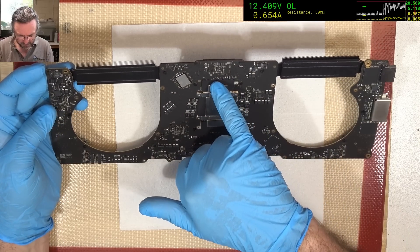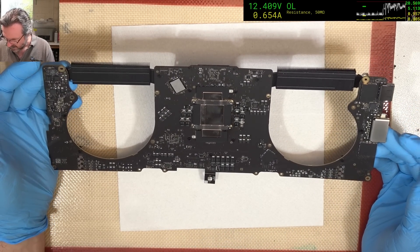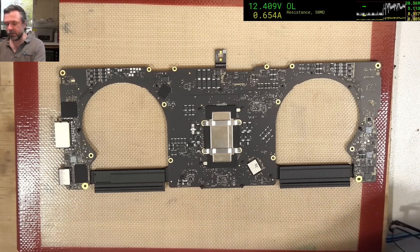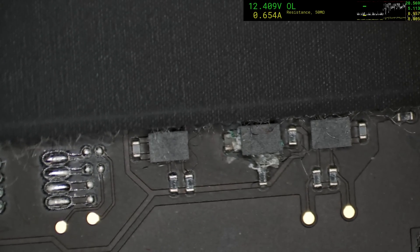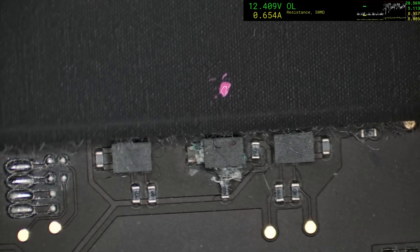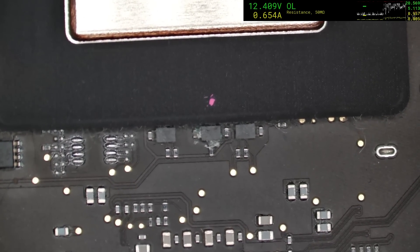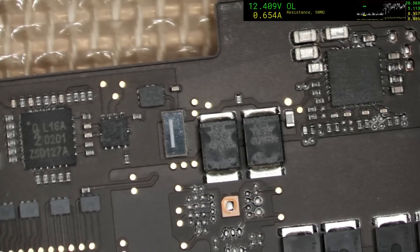I can immediately see there's some corrosion down here by the base of the CPU area. It's not unusual, let's have a closer look. Yeah, that's some well and truly advanced corrosion going on there. I'll put a little pink dot to mark it and have a look at the rest of the board — if there's one there's possibly more. It does look like a bug event. Looks like that's probably the only one, so we'll get this CPU barrier removed and have a look.